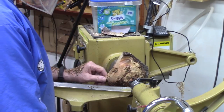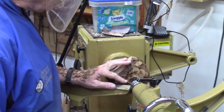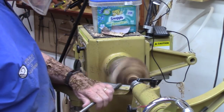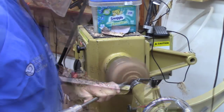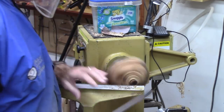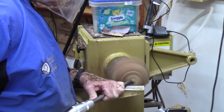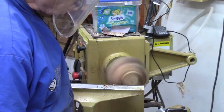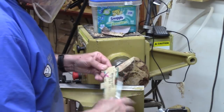Let's finish taking this off and see what we got. This one looks like it has a little tougher wood at the bottom with voids right there, so I may go ahead and put a tenon on this one — take it back a little bit further. Let's get rid of this little scrap in the middle. This is solid; this will make a nice tenon, so let me find a pencil and give that a shot. We're going to use the tenon.